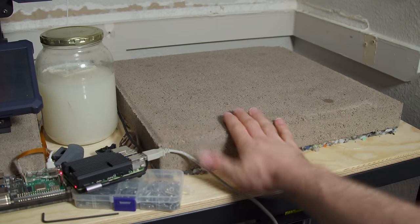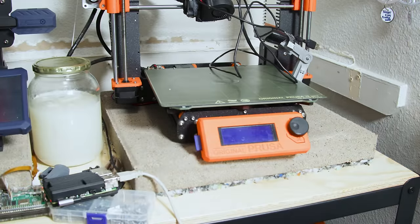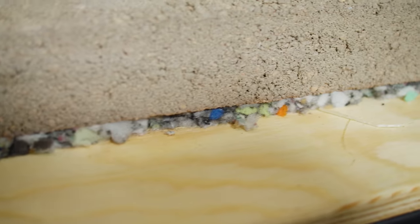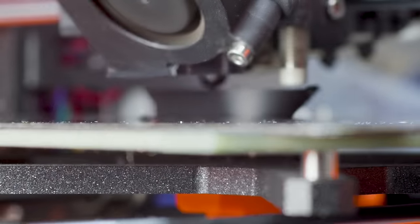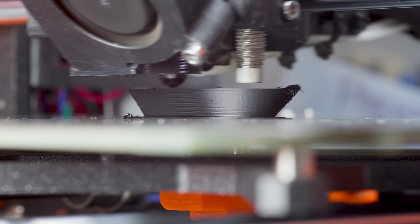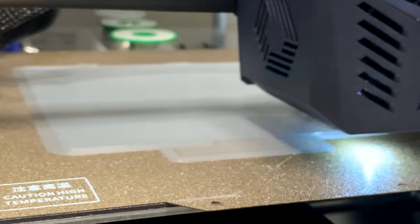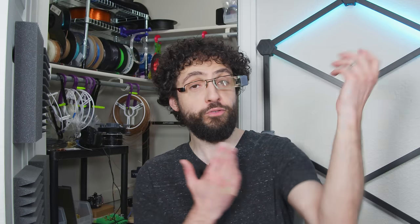You might have noticed that each printer is perched on a cement slab, which itself is resting on a bit of carpet padding. These might not look like it, but they are exactly what they look like. This is a cheap-ass yet effective-ass hack that I learned from the much cooler-ass YouTuber CNC Kitchen, and its main job is to contain vibrations. The padding and the extra mass from the big-ass rock quiet down the machines, which is really important because I have to print while I record sometimes. Preventing the thing from shaking also improves surface quality, durability, and keeps one printer from interfering with another. In the corner we've got the Squirt Viper — that's an AnyCubic Viper the company sent me for a sponsored stream. This is basically an Ender with a package of pre-installed upgrades, and the truth is that three FDM printers seems to be enough for me, so I plan to dump this on a maker in need for the purpose of virtue signaling.